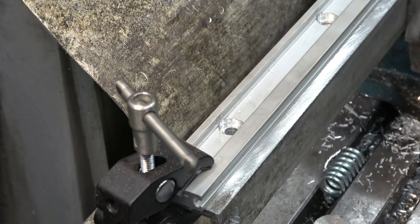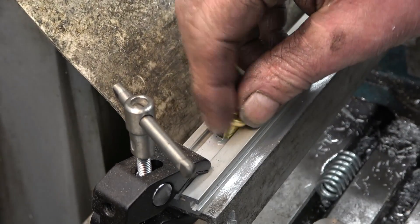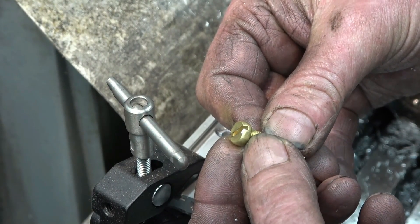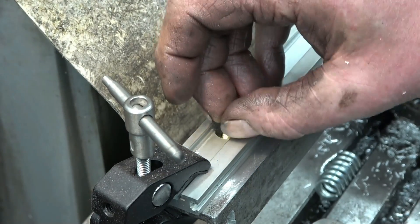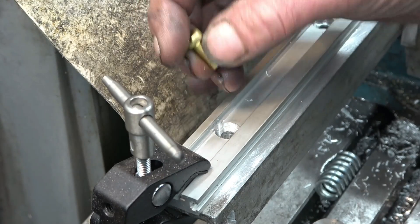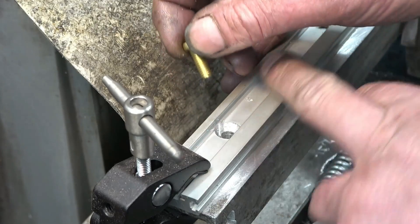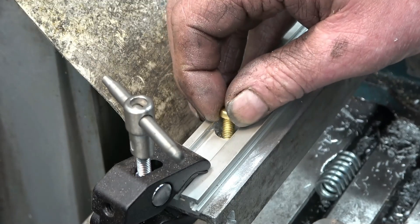Because I bought this scale separate and that's part of a kit, there's no fittings for it. These are the nearest thing I've got to go through there and they're sticking up proud, so I have to take a little bit off the shoulder and a little bit off the head to get them to go down through there nice and level. I've got nothing else suitable. I'll get to machining them, get that screwed on and I can glue the tape on, put the stainless steel protector strip in and that's the first part of the job done.